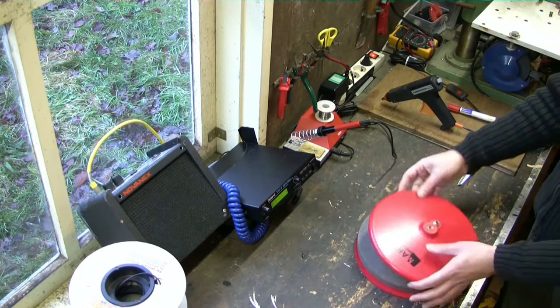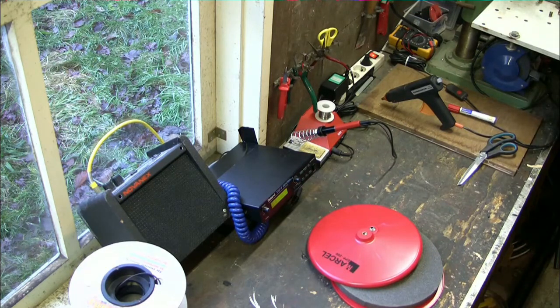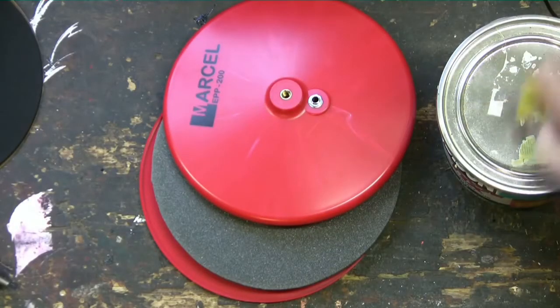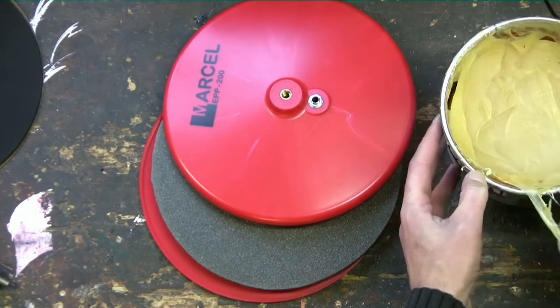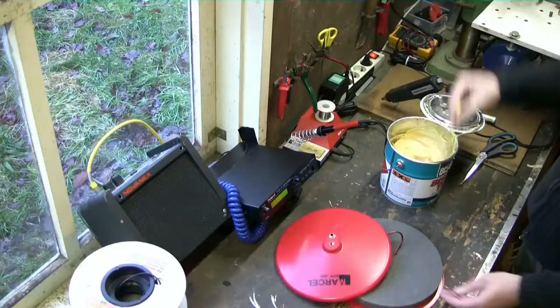If you need to hit it very hard, the material might be too thick, so you may need to rethink your choice of material or the thickness of the top plate. When it works fine, it's time to glue the parts together. I use Tix glue, which works well on foam and plastic. You can buy Tix glue in a bucket, like this one, or in smaller tubes.